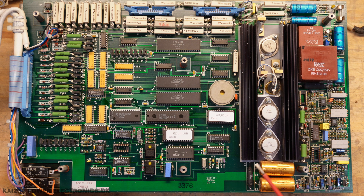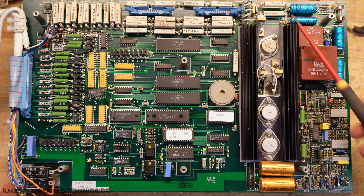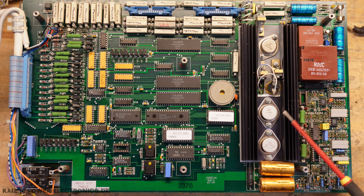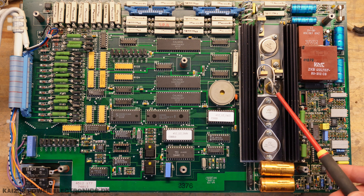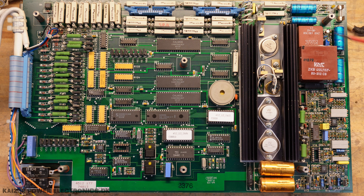The power runs all along here — that's the 40 volt DC. Here we have 100 volt DC rated electrolytic capacitors, and we have a huge power supply here which seems to be giving out two different voltages. All this over here is the internal housekeeping power supply design. We seem to have a single controller here, but there are two sets of transistors, and really a custom job of making a hole into this heat sink for the thermal switch. We have two inductors and two separate parts of some output filtering, so I guess we are making two different voltages. One thing to notice is that all the ICs here come from either Siemens or Philips, perhaps just with a few exceptions.